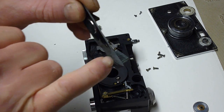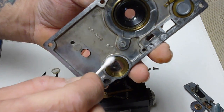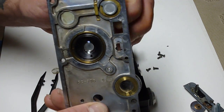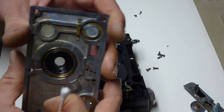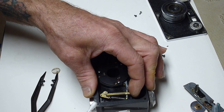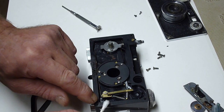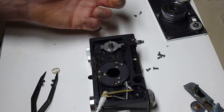That tiny little point right there — that's what presses along here and makes your adjustment. It's a graduated circle: starts out low, ends up higher. And for the shutter speed, there's also a low spot and as you turn it, it gradually increases, pressing on this arm here. So as the grade increases on that, it pushes down on this arm, which pushes this lever, and that should be connected to a mechanical clockwork timer of sorts that controls your shutter speed. I can't show you anything about the shutter because this shutter has already been sacrificed. But really, that's the bulk of it.